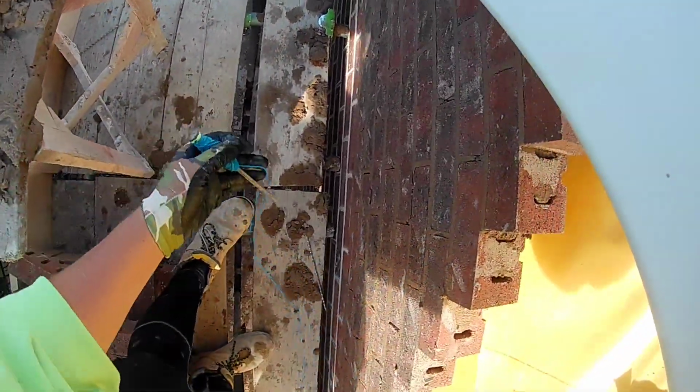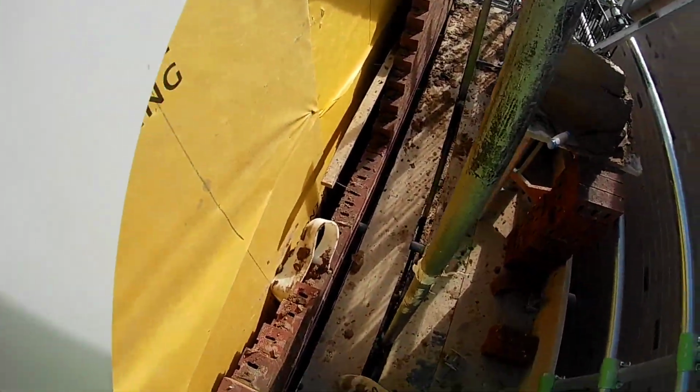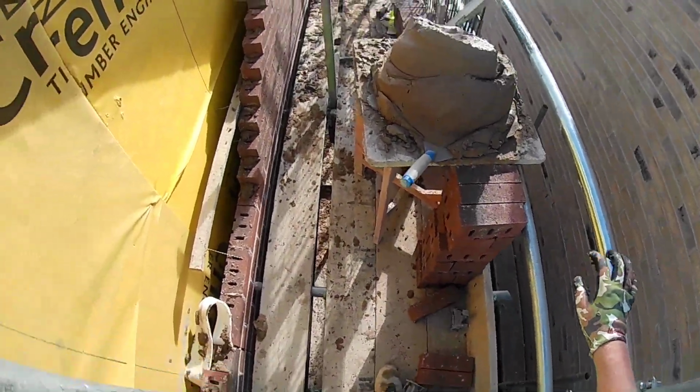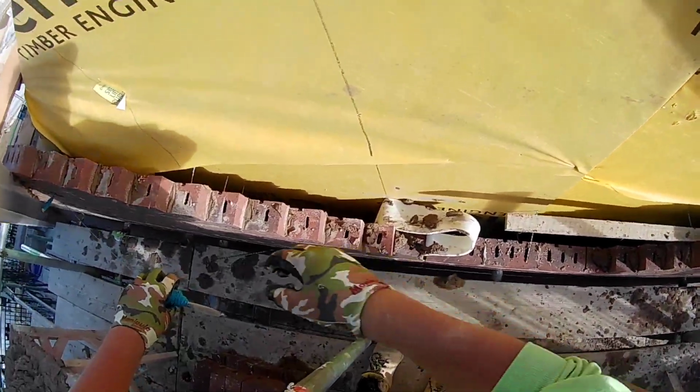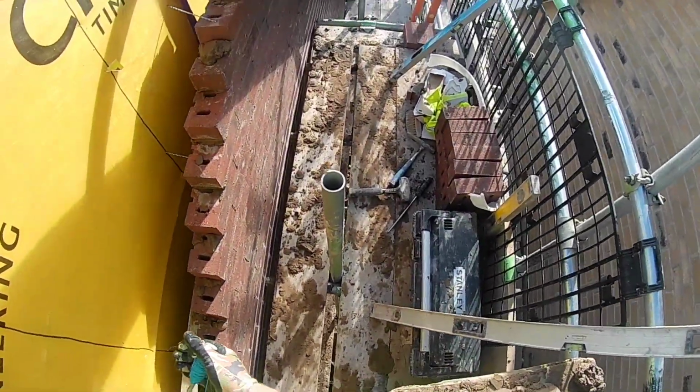And then I'm going to drill a hole and stick a profile up each side to build them a bit easier. Also, what I like to do is stick a couple of tie wires out to support that reveal block piece, and I put a tie wire in every reveal block anyway, so they don't break off when you try to strap a patio door to it or stuff like that. So that's what I'm going to be doing.